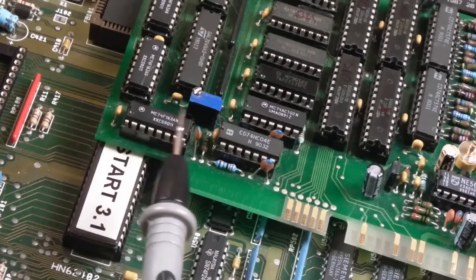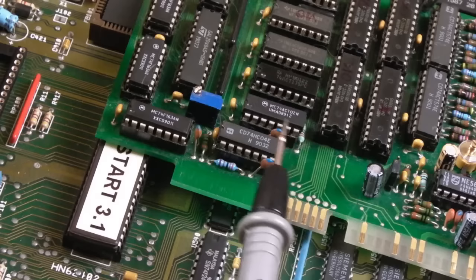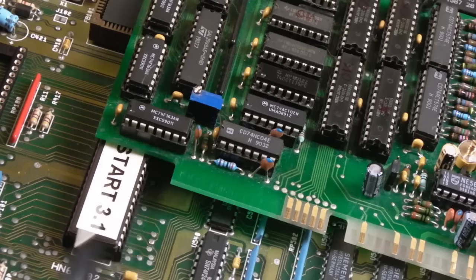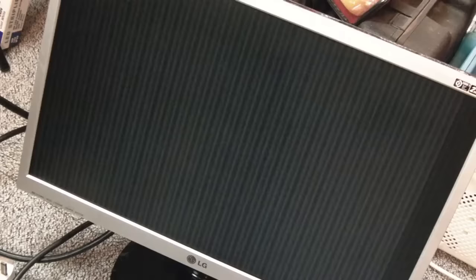It's easy to assume this is a CMOS chip and the voltage is being adjusted, but this is a 74 series counter — a 163 I think. If it hasn't got five volts it's not going to do very much. Once you get down below three and a half to four volts it'll just stop working. I'm tempted to join a wire from the VCC pin here to the VCC pin there. What a surprise — it now works again!